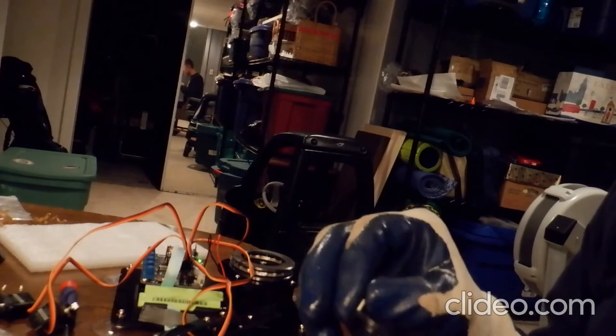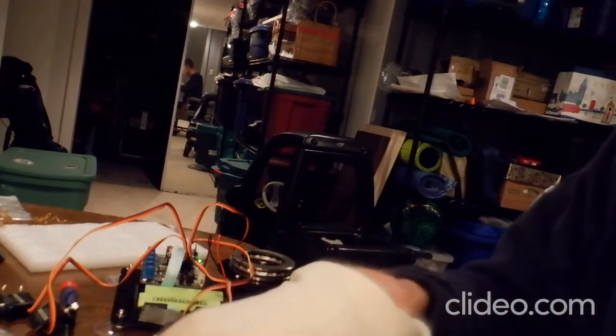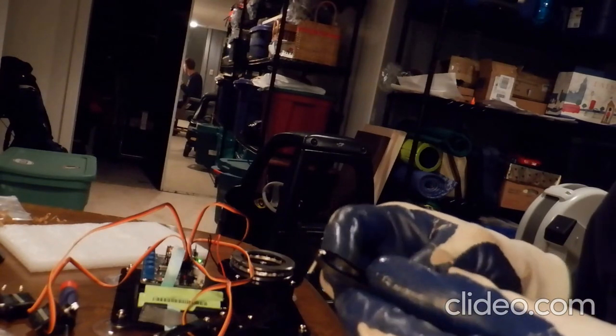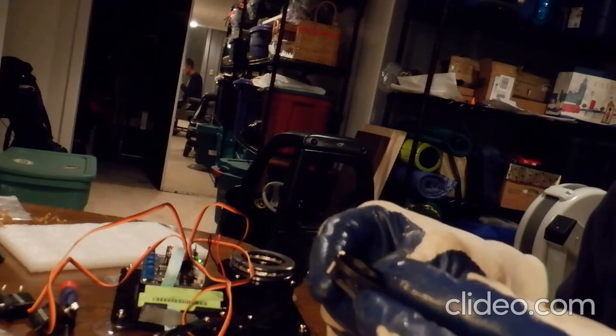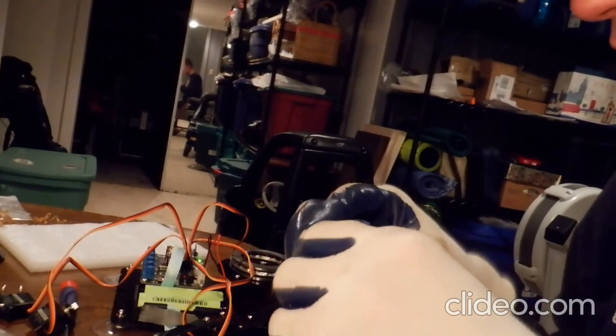and they're attached. I'm going to take two M2x10 screws, two M2 nuts, and I'm going to attach these two acrylic pieces, one arm, one spacer. You'll note the spacer is the same identical piece to the one that broke on me for the other arm. And I'm attaching these to the servo that is wired as servo number 3. These bolts go through the arm first, then through the spacer, so the fatter part of the spacer goes on the top of the arm.